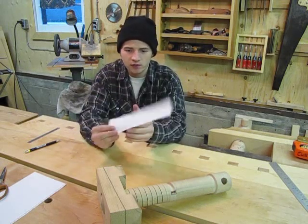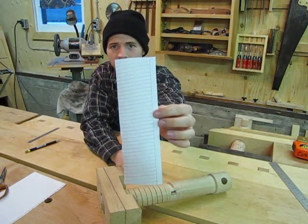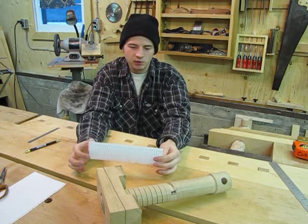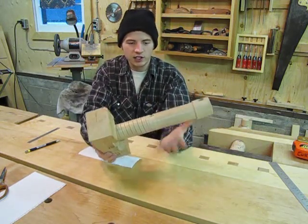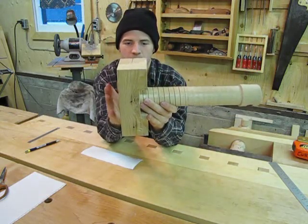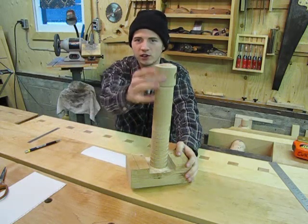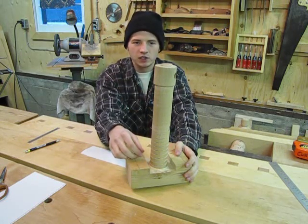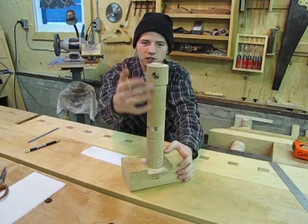After you have the paper all laid out, you can cut it to length and to width. I cut it a little bit wider than the lines were laid out, which gives you a little more tape to the dowel. When you cut this out to length, it only needs to be approximately two thirds the length of your dowel. Because once you stick the dowel into the guide, the full length of the hole is filled with the dowel, and you can measure from that point to the hub. You don't have to add a hub like this, though it would have been a good idea for the other dowel since it's so thin. If you don't add a hub, make sure the hole for your handle is a little bit lower so that it doesn't split the top as you're turning it.